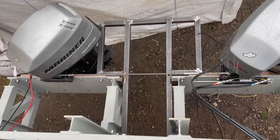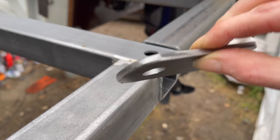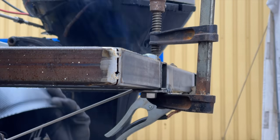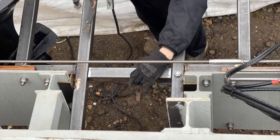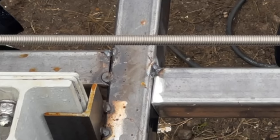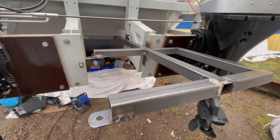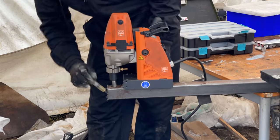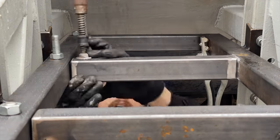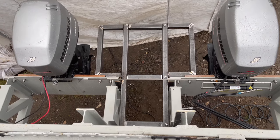From the top we can see that we nicely filled out the available space, leaving just enough room for the motors to turn left and right. Now I can weld in those plates with a hole in them, and as always I only attach them with a few tack welds for the time being. With this next piece, you could think I made a mistake when choosing the position, as it's slightly offset compared to the position of the wings, but that's actually on purpose on account of the wooden boards I'm gonna put on the platform later on. Next I'm gonna remove the port side half of the platform in order to drill some more holes into the frame, and then attach the remaining connection plates and shorter steel tubes in between the two sides. With that, the structure of the platform is done, and now all that's left is to finish the welding and close some of the holes in the steel tubing.